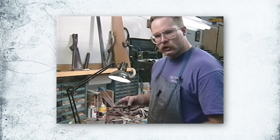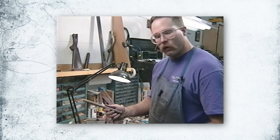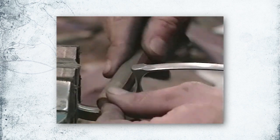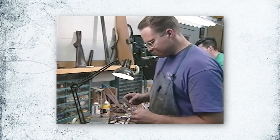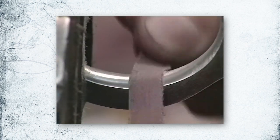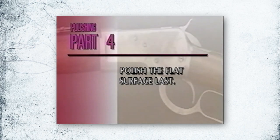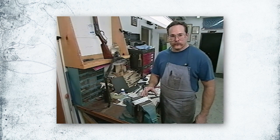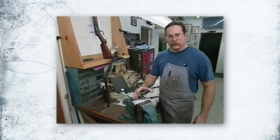For some of the curved inside surfaces, I'll use a round wooden dowel — it makes it easier to get into some areas. Remember to keep changing the angle. Take a thin piece of paper, wrap it around, and use pretty much the same method as a shoe shine. Polish the flat surfaces last to get clean, sharp edges. Remember, only the final polish needs to go in the factory direction. Once your rounded surfaces are all polished, it's time to do the flats — doing the flats last will give you nice, clean, sharp edges.